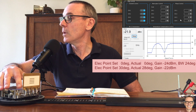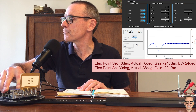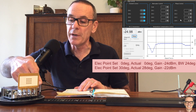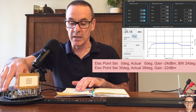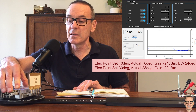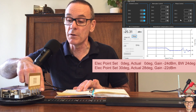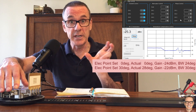So now we need to go to minus 25 to get the 3 dB beam width. So let's go down and find minus 25. And we spin it around here — there's 25. And if I look on the graph here, we've come 15 degrees around from the 28 degrees that we got as a peak. So let's go back in the other direction and find where it drops down to 25 — here we are. And that's also 15 degrees in the other direction. So now we have a wider beam — this is now 30 degrees of 3 dB beam width.